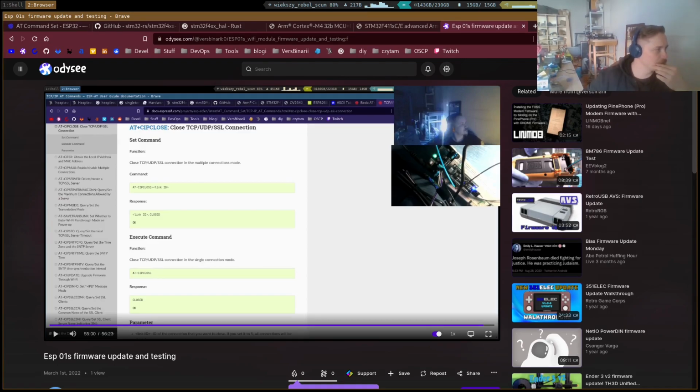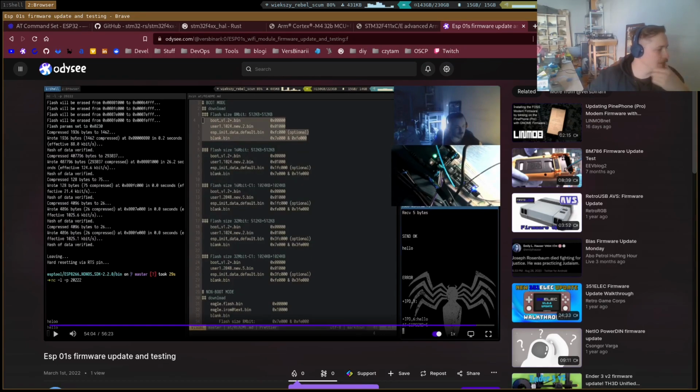Which brought it up to the latest firmware, and then we did some actual testing, and we managed to send the data from the module to the netcat listener on the host machine over the Wi-Fi. So that was good progress. I think now we will be able to use this and send UDP or TCP data across the Wi-Fi to whatever listener we're going to have. So yeah, if anybody's interested, that video and all of the other videos are available on Odysee on my channel.